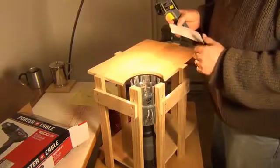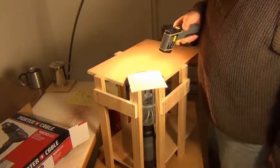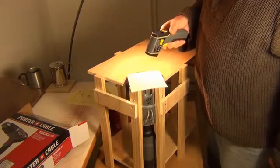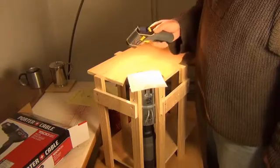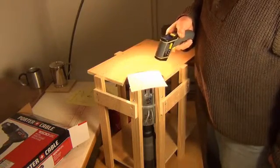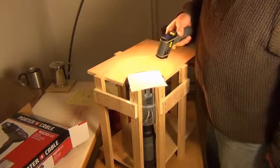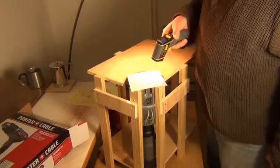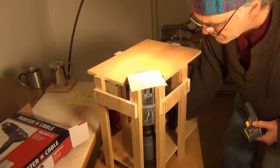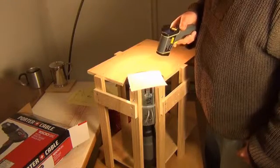Okay, just let it heat up for just a few seconds, and then I'm going to put this on here and I'm going to measure around. See, I'm already up to 170. Whoop, wait a second. There. I'm already up to 122 Celsius there, but over here in this area it is 80 degrees Celsius. So I want to move my heat gun toward the coolness, toward where the cool setting is. There, I've got that.